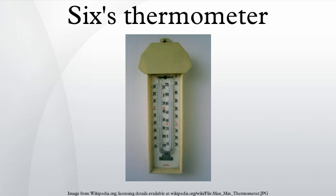The thermometer shows a reading at the top of the mercury section on both the maximum and minimum scales. This shows the current temperature and should be the same on both scales. If the two readings are not the same, then the instrument scales are not correctly positioned or the instrument is damaged.